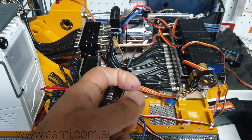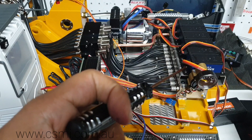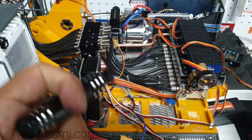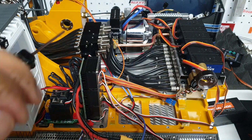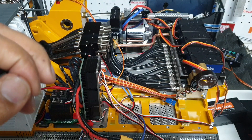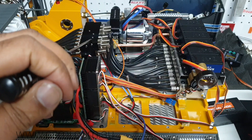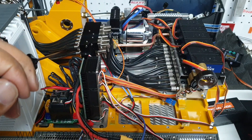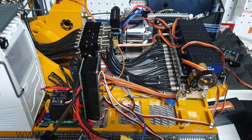There's a complete kit that includes the brass pipe and all the valves. You don't get the servos, but you do get the servo mounts, and there's a suction line on that side - all of that stuff will be included and posted out to you. We also have a manifold up here that distributes all the oil, so you don't have the bends and creases in the hose. It actually comes into this manifold and is then supplied again from the other side, distributed to the right section of the light piping and hoses.